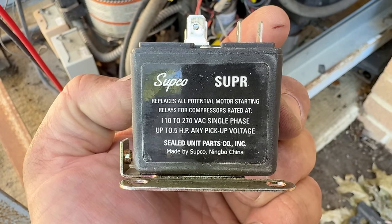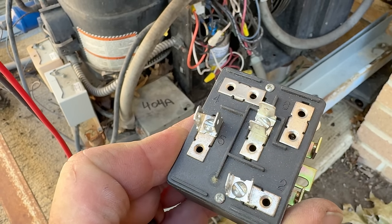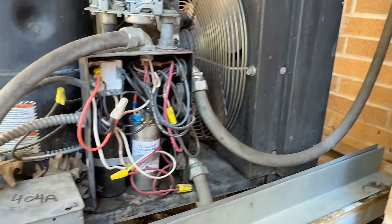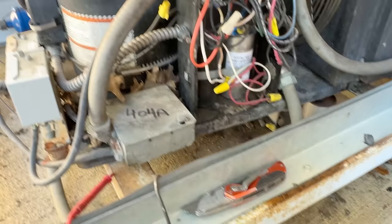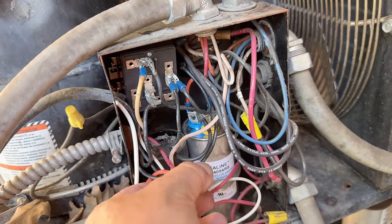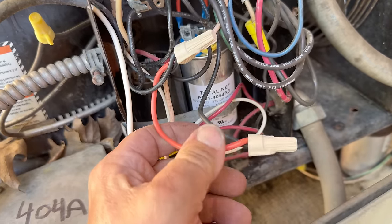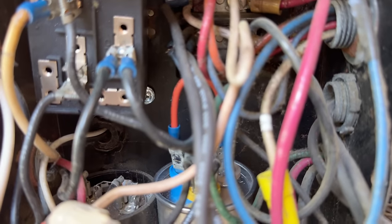So I've got one of these SUPCO universal relays here — it's universal. I do not trust these for permanent, but it's good enough to get them by. I already have it booted up — one, two, and five. Let's swap this over and see how it does. Power is back off again. I always double-check my shorted terminals together — even though it's got a bleed resistor on there, I'd rather blow a capacitor up than get shocked. So we got the SUPCO mounted in there, got a tap and zip screw in there. Let's see what happens.